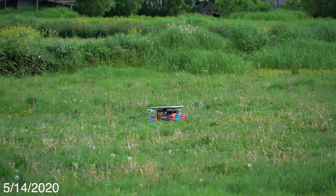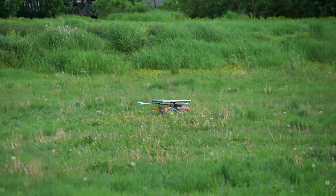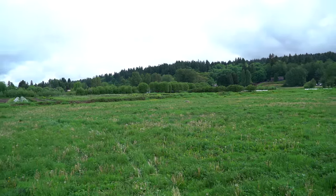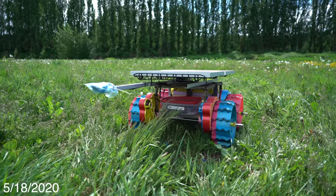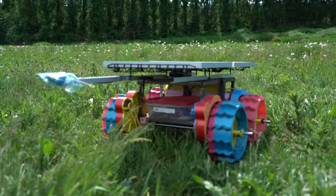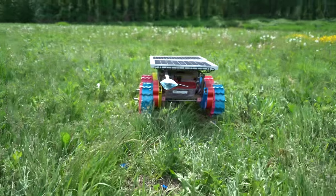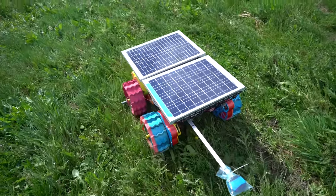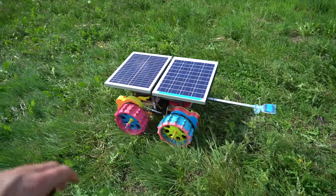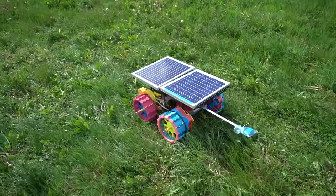It's a new day. Last night I tuned the steering control loop a bit more, so I'm just going to let it go all day again. I'm very impressed with how the ArduRover code handles being in hold mode. Whenever it doesn't have enough voltage from the sun, my Arduino puts the autopilot in hold mode — basically just meaning it stops driving. Even after being in hold mode all night long, right as the voltage rises in the morning, it just starts driving again right where it left off. It doesn't even lose the current waypoint.